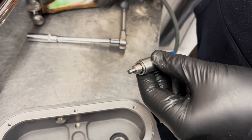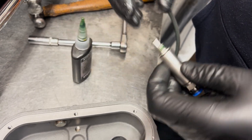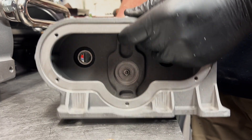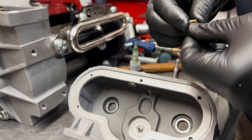Remove the nut from the air piston. Add a small globule of thread lock onto the thread on the air piston, making sure that the dowty washer remains in place. Insert the air piston thread-first into the 10mm hole you have just made from the outside of the top housing.